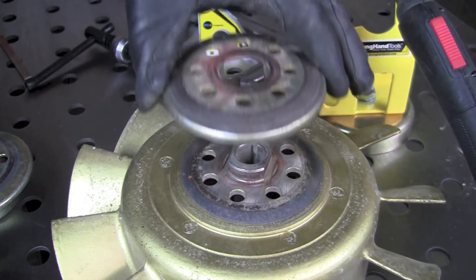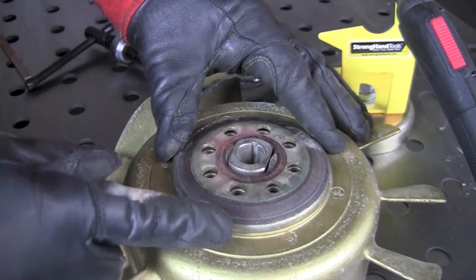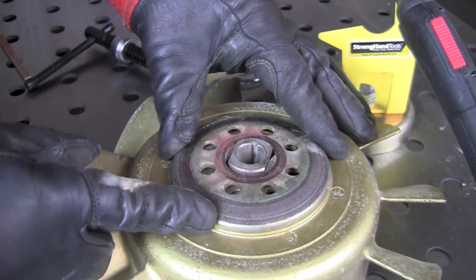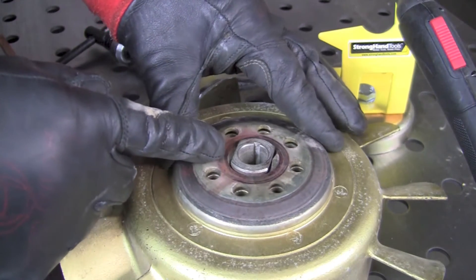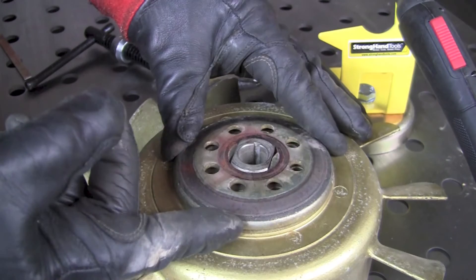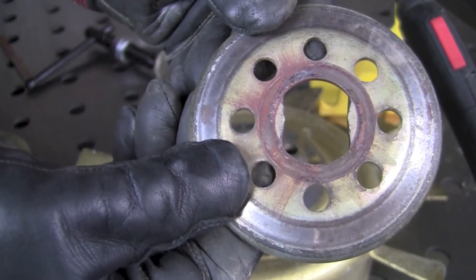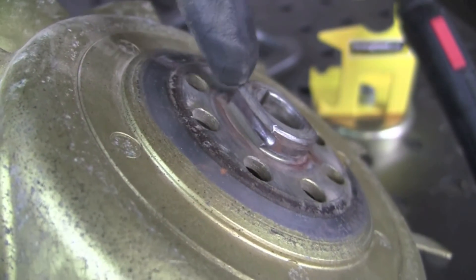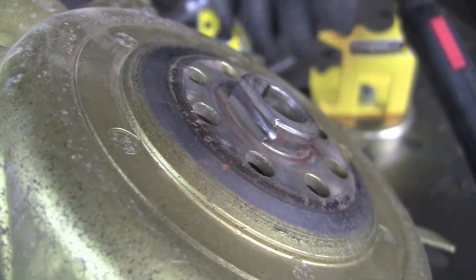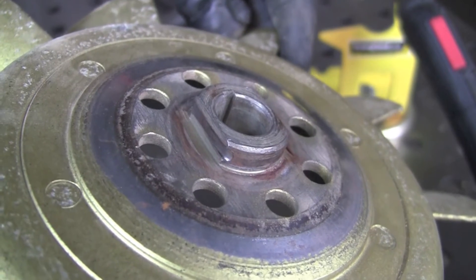This other piece goes over here and it's got some fasteners that go through these holes, but if those fasteners get loose then the part will tend to rock back and forth. We can see the wear that's taken place on this outer piece, and we can also see a significant amount of wear right here along that shaft assembly. That's what we're going to try to overlay and take care of here.